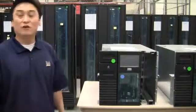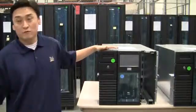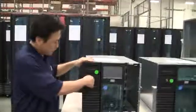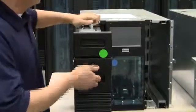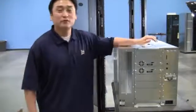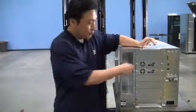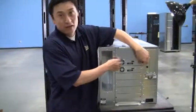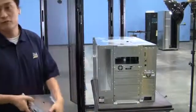After successfully installing the slide assembly into your rack, prepare your library for installation. In this library, the right side matrix has already been removed — go ahead and remove the left side matrix as well. After removing the two storage matrices from the front of the library, go to the back and remove the tape drives to decrease the weight. The RLS libraries are very heavy, so before trying to put them into the rack, remove the tape drives.